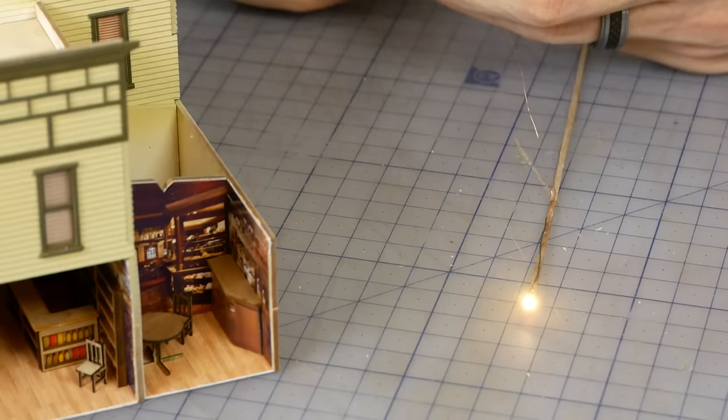Whenever I work with foam, I always add a sturdy frame to help prevent warping over time. A simple frame made from pine is measured and cut. I used polyurethane glue to glue the foam to the wood frame, and screws are added for good measure, and once it's all done, I add clamps in appropriate spots until the glue cures. While the glue is curing, I also weigh down the foam to prevent it from moving.